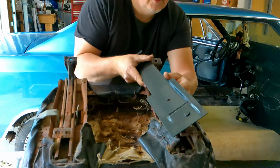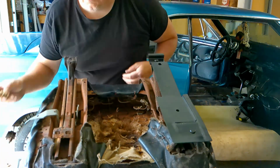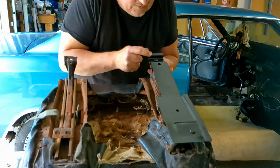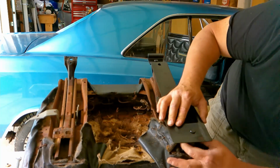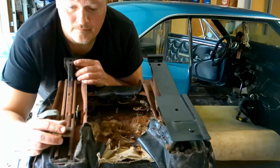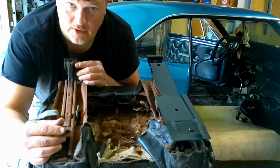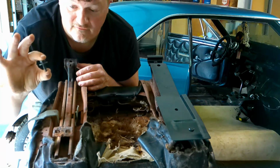So it's got the studs. You just put the stud in the hole. In this case, it's the outside hole. We also have our new fastener kit from NPD. And I just want to snug these up. I don't have to tighten them real tight. The outside rear fastener is used from the bucket seat and the bench seat. So this hole for the rear is already in place, and the kit comes with a bolt, a fastener.